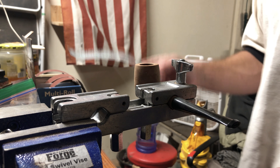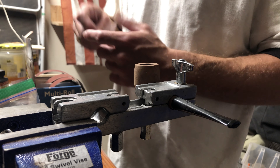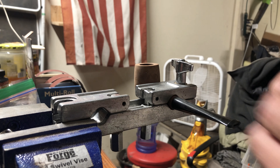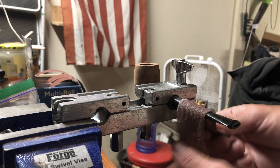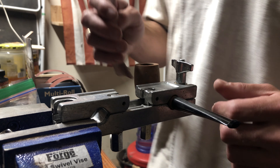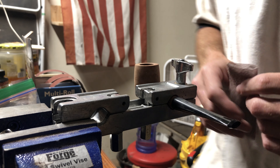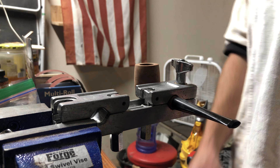And then you can always — so this is 600 grit — but then you can always move up. I find that the Mirka Abranet is really good. You can even take this and go like that. It's just a lot easier than trying to sit there with it in your hand. If you just work your way up the grits of the sandpaper, you can get a really nice finish and get a lot of the scratches out probably in half to a quarter of the time.